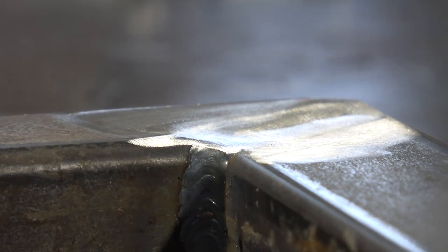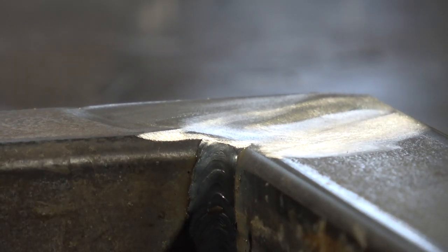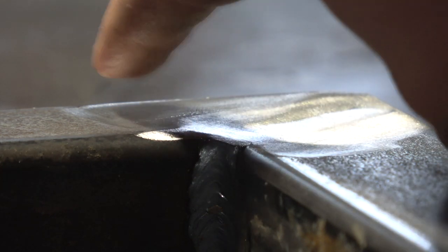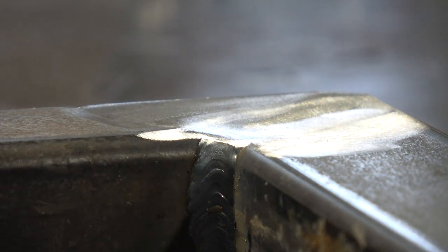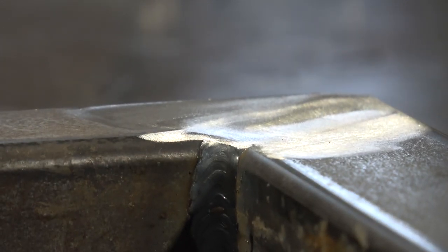The camera actually picked that up. So this piece right here actually sits — you can see the ridge right here — this piece sits up about a 32nd of an inch higher than this piece. It's not very apparent when you're looking at it from afar, but when you get up close you can kind of see that out-of-flatness. It's good enough for what I'm going to be using it for, especially since this is the bottom side of my project.